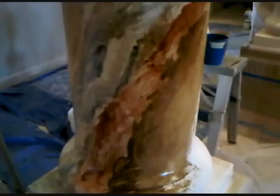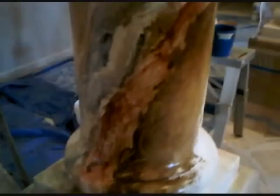Obviously, if you badger it, you have a better chance at coming back now and leaving some darker spots. So maybe this area, I wanted to see a little bit of darkness. And maybe I've decided that I'll badger out that bottom portion of the brown and leave just the heavy spots at the top. You want different levels of saturation, different placements. And now you'll notice I'm going in really straight, intentional strokes. You can push the glaze in a direction by doing that. And that also leads to the illusion that there were more minerals pushed in that direction when this marble was formed.